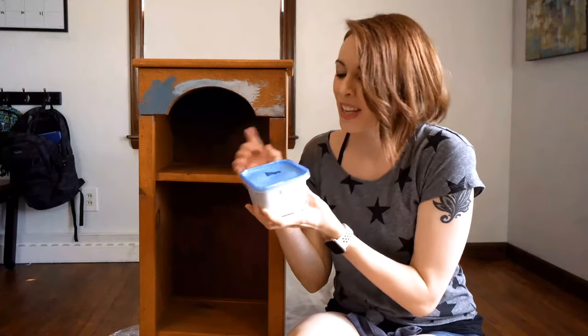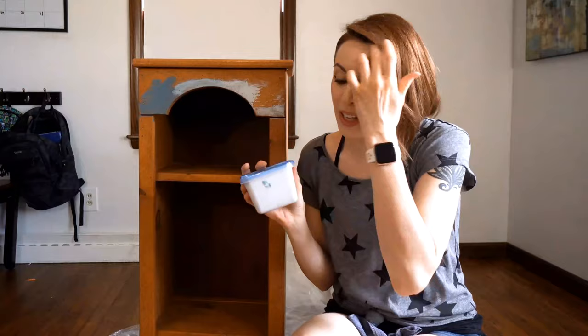So I'm going to show you how to refinish a bookshelf from a thrift store from start to finish. My first step is to paint it with chalk paint. I am going to use my homemade chalk paint recipe. Now, I have a video on how to make homemade chalk paint, so you can check it out in the description box below. And what's so great about chalk paint is you don't have to worry about sanding. Basically, chalk paint takes the step of sanding out of the picture.